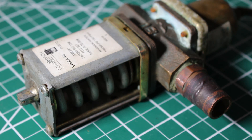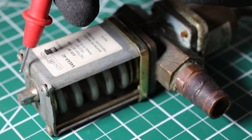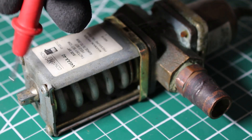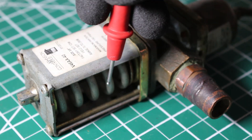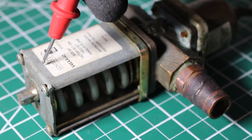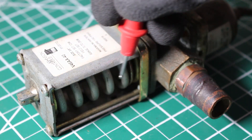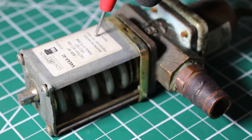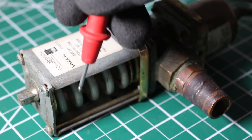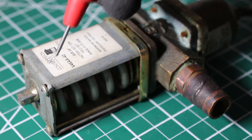Let's do a quick review. We're going to make our adjustments on the stem. As far as going clockwise or counterclockwise, that might be specific to your valve, but make all your adjustments here and pay attention to your spring. When the spring is up relative to the top of the valve, our pressure is going to be at its lowest. As we turn the adjustment knob and bring the spring down, we increase pressure. Spring down: increase pressure. Spring up: decrease pressure. This is achieved by increasing or decreasing the water flow.